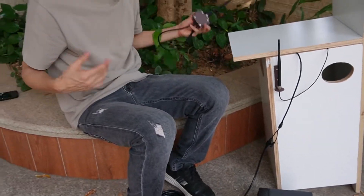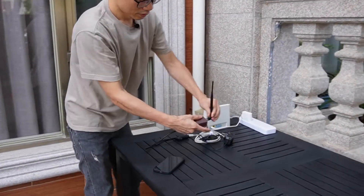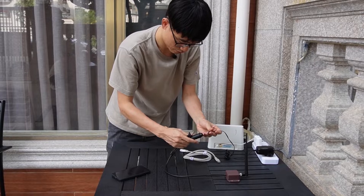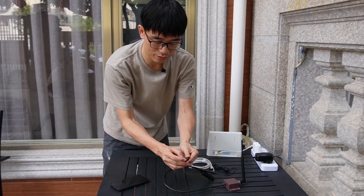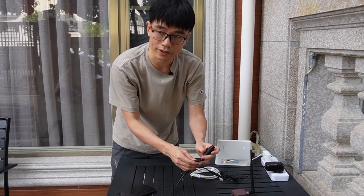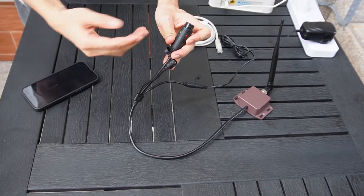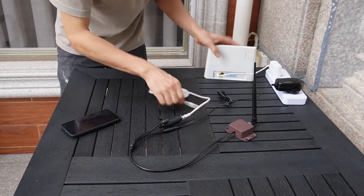Now let's move to the router. You just need to place this receiver next to the router. The receiver also needs power, so let's power it up. Here is the terminal for power and here is the reset button. The reset button is not used to reset the camera — it is actually used to synchronize the signal with the camera. The red indicator being on means the camera is working with the receiver. If needed, press the reset button on both ends and it will take a few seconds to get the signal synchronized. Now connect the network cable to the network port of the router.